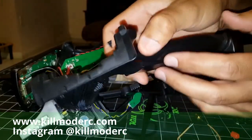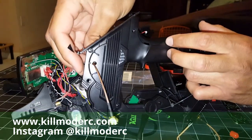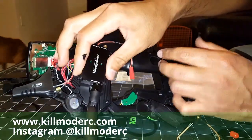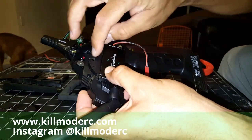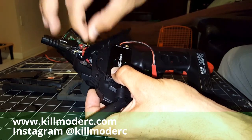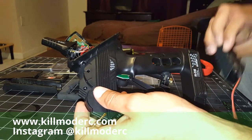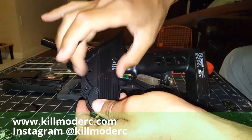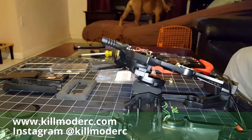What you're going to have to do is drill a hole — however you're going to mount this is up to you, whatever is comfortable. I'm going to mount this somewhere along the lines here, probably using double-sided tape, and I'm really going to want to reinforce where the wire goes through — whether you use hot glue, silicone, or super glue — because you want to hold that in place. You don't want that to be able to pull in and out and unplug from your circuit board. Then I'll run the battery down to the bottom and back up, so you have the battery in the bottom, the booster here, and the cable will go through and connect to your transmitter. It's a pretty simple setup.